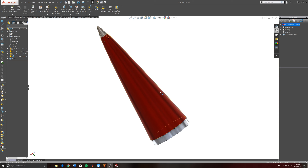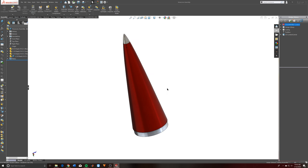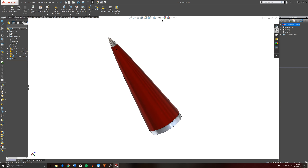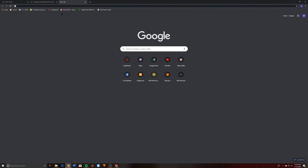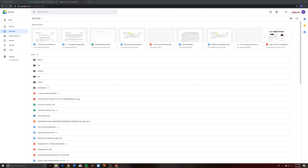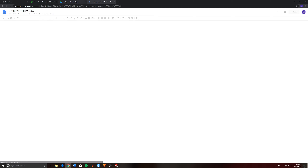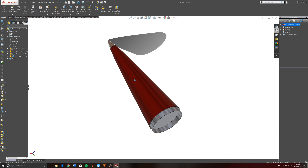Welcome back. Today we're going over some of the new changes to the nose cone that we talked about last semester and finally got around to putting into model form. A few major changes: the general shape of the entire thing has changed from an LV Haack series of one-third to a nose cone called the LD Haack series, with the coefficient only being zero instead of one-third.